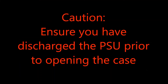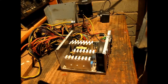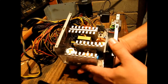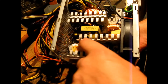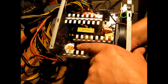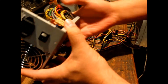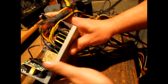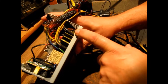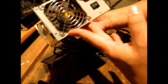The most obvious thing in here is this capacitor — it's definitely not flat and there's a texture on the outer casing. The rest of the capacitors look relatively okay, except for the fact that they are OST capacitors, so they'll be coming out for sure regardless. We tend to freely discriminate against OST capacitors, amongst a few others.